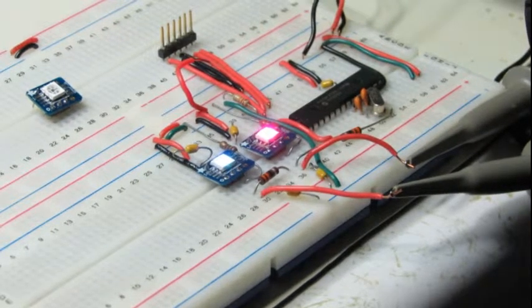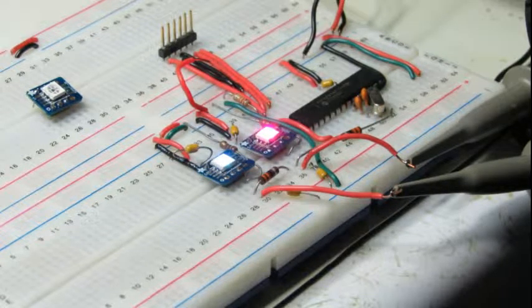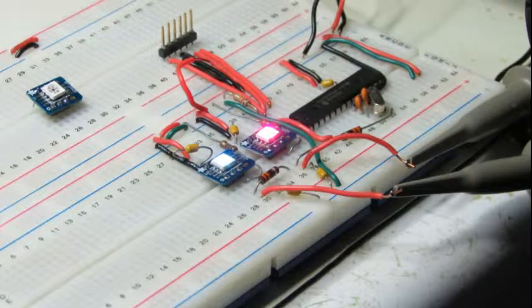At 250 nanoseconds, that's going to be 26 instructions to get done before you get ready for your next bit. We might put in a 20 megahertz crystal and maybe do some more timing or see what we can get away with. But now I think it's time just to look at some color values and see if we can generate whites and intensities and things like that. We'll do that next.